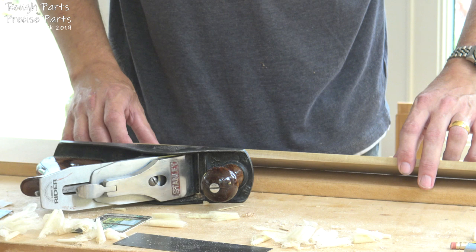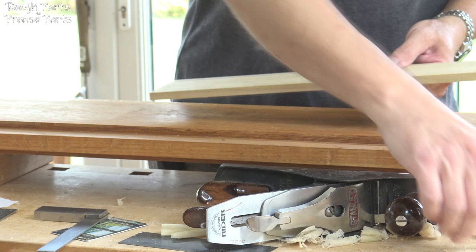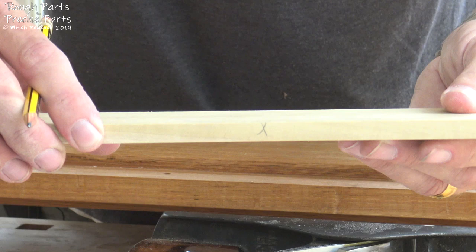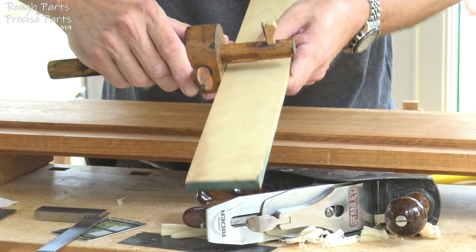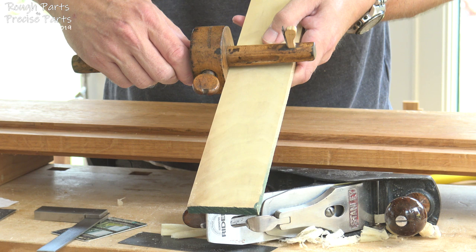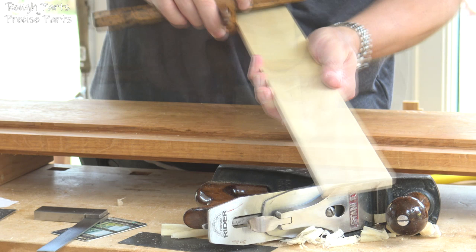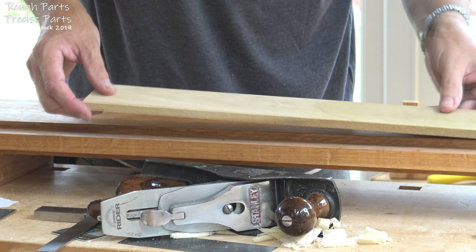I can use that edge now — let's give some terminology. This edge is now the face edge; this flat side is the face side. We put our little mark on there. Using the face edge and the marking gauge, set that to the width we want — in this case I'll go close to the width of the board. Scribe that around. Now I can follow that knife line with the plane. It's definitely wedge-shaped here so I'll be taking more off one end than the other with some stop shavings. Bring it down to that line, we'll be the right width, and all we have to do then is cut it to length.